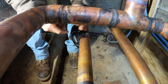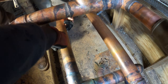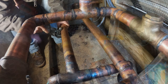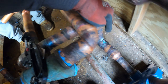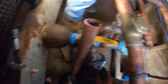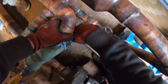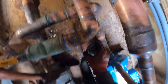My partner and I are cutting the pipes. The idea is to go from the supply and bring it in here so we can feed these two pumps — going elbow and elbow so the water comes around and feeds both pumps. We opened things up so the pipes can breathe and drained the remaining water, because you can't braze with water in the pipes. This is your strainer — see there's water in there, you want that drained.